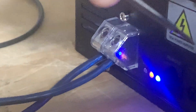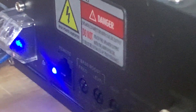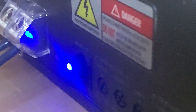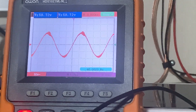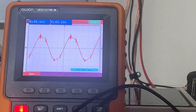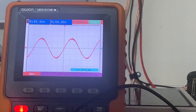It's showing clipping — let's turn it down just below clipping. So no clip light, just flickering ever so slightly. There's your distortion on the waveform. You can send it way into clipping and you can see the line kind of split. So on this style of full bridge, just into clipping you're going to run into distortion before actual clipping — you've got to turn it down to get it clean.